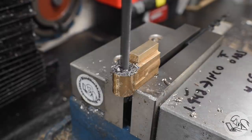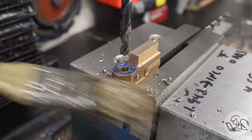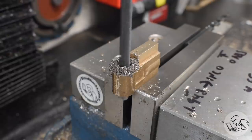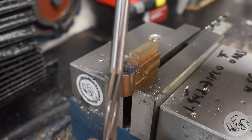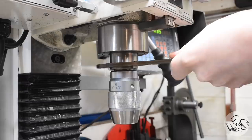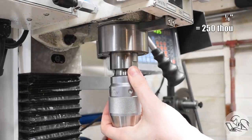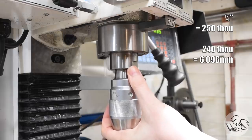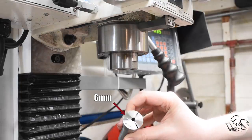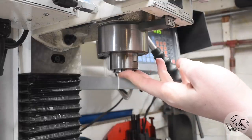Drilling done, ready to ream - and no, it doesn't fit, because of course it doesn't. This is another small mill problem: reamers are always too long and always have weird shank sizes. This quarter-inch reamer has a 240 thou shank, which is quite an annoying size. I don't have a 5C collet that's 240 thou, however that's extremely close to six millimeters, so I actually ordered a six-millimeter collet to put this reamer in and ream this hole. These are some of the things you deal with on tiny machine tools.